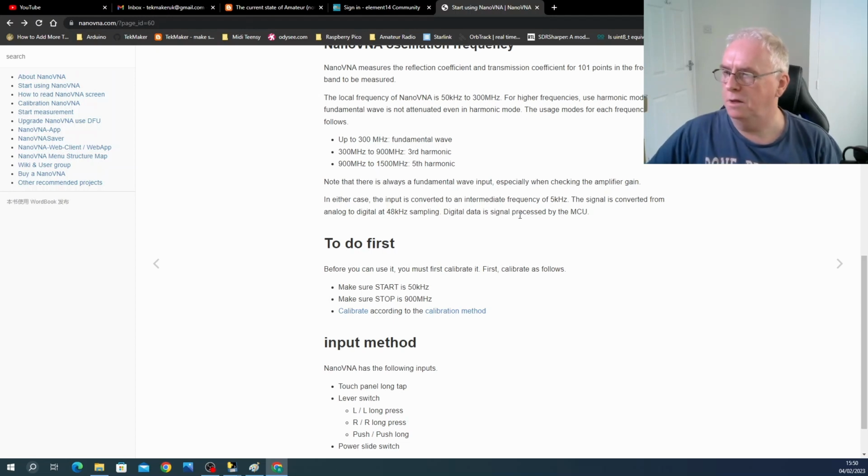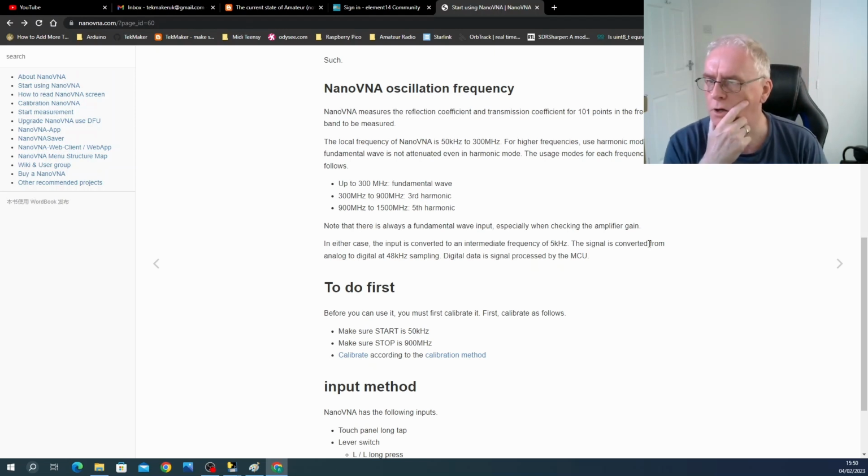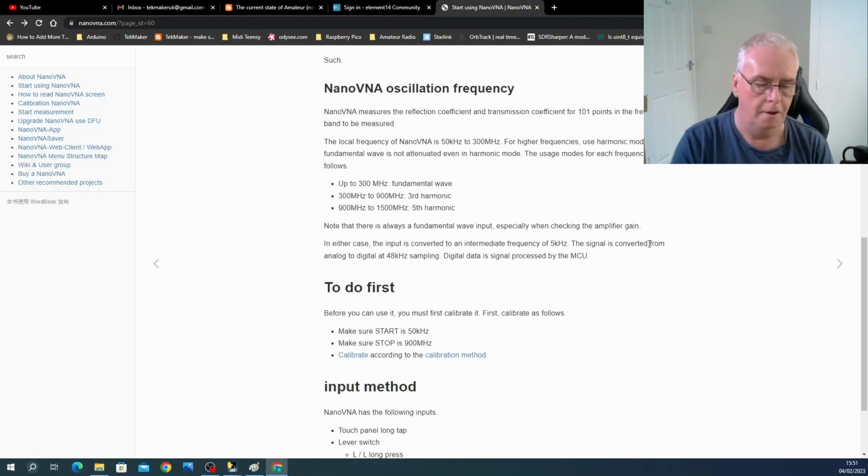I haven't tried it on anything that goes up to gigahertz, but if you're playing around with LoRa or 1080, 1090, is it ADSB? Those sort of things. LoRa's 868 megahertz. Well, they need an antenna about 1 inch long. And you can design these things and optimise them. I'll hold my hands up to say Andreas Spiess did a brilliant article introducing that concept. His stuff is excellent as always, amongst many other people. Kevin Loughin. Those guys have covered other aspects of this that I don't want to go into. I just want to use it as a tool and get my ham radio set up the way that I want it.